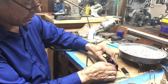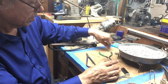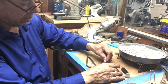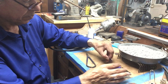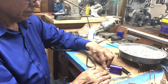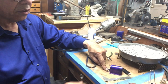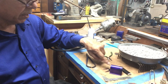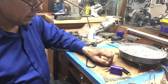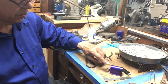Just like that. Now the end plates will have a place to rest when I get ready to solder them in place. On to the next step: preparing the surfaces for soldering, making sure they're cleaned up, getting some iron wire to get some compression around this so that it's tight, and then the suitable application of heat for the soldering.